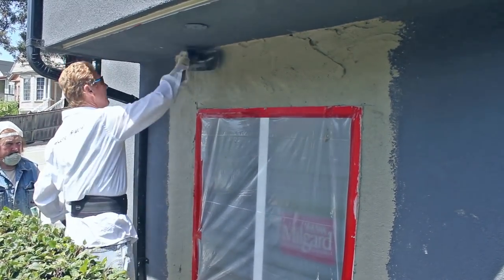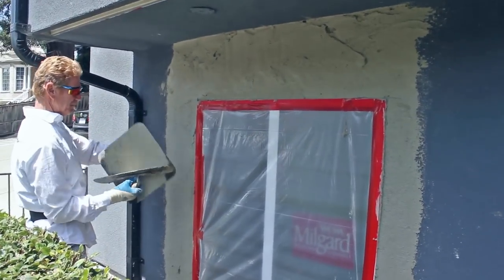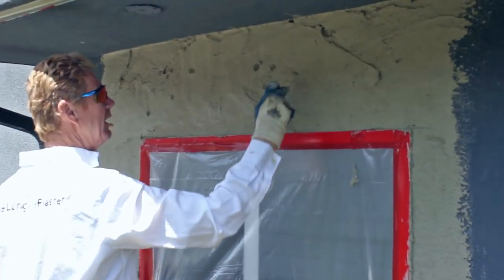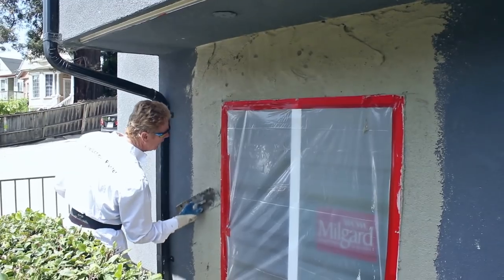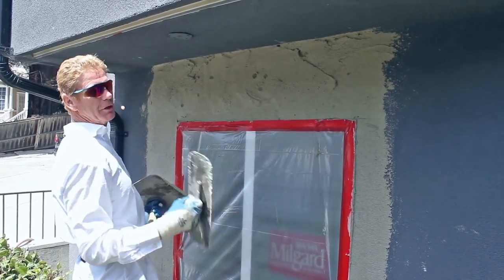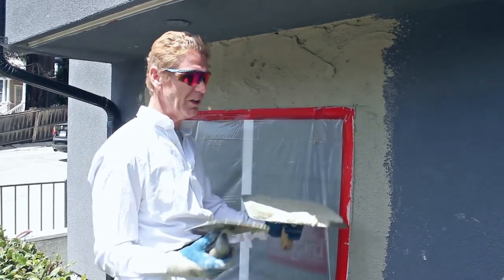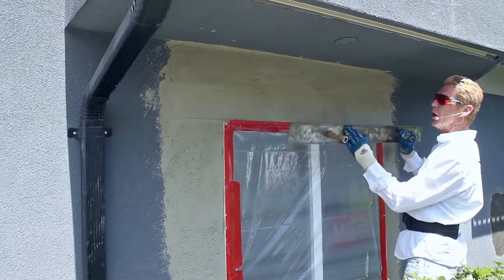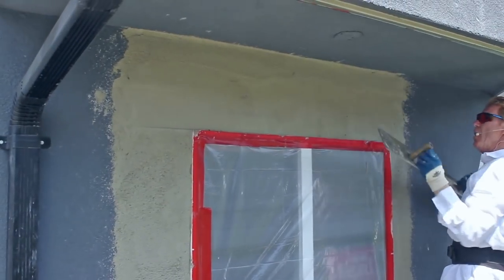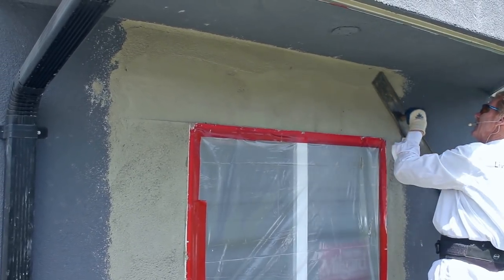It's been about 20 minutes from when I first started. I'm taking a rod straight-edge Darby and wetting it — the first mix was a bit sticky with too much water, it happens even to us professionals. I'm going to allow this to set five more minutes. This is a five-minute mud — you can't play around with it. I'll show you how to float it and how you can match this texture, but that's not what this video is about.